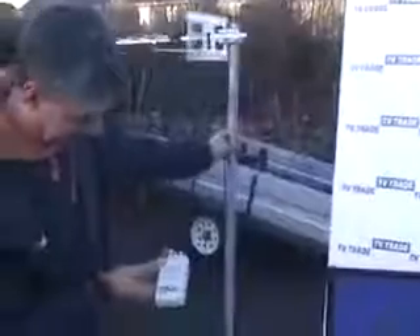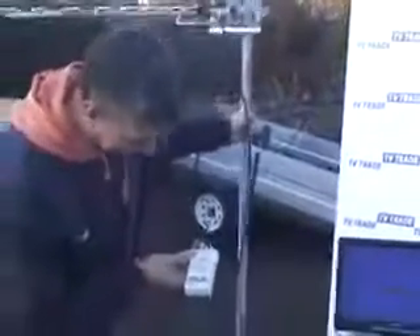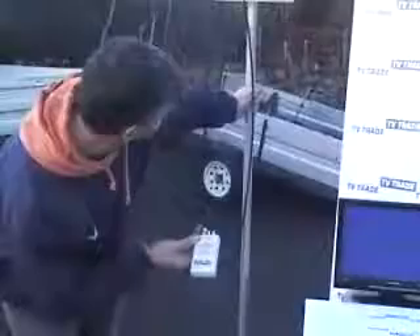What I do now is slowly rotate the aerial around. It's one LED, now it's into two LEDs, and it comes around and around as we go — now we're into three LEDs, four LEDs there, and back here. We can see that four LEDs is as powerful as it's got, because when we went past that point it dropped back down to three LEDs. Now we disconnect this meter, connect it into the back of the television — and bingo, we have a perfect picture. It takes a lot of the guesswork out.